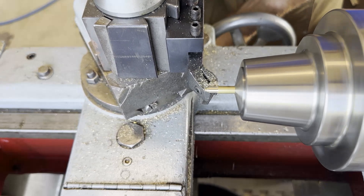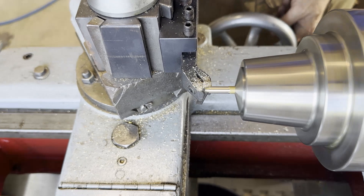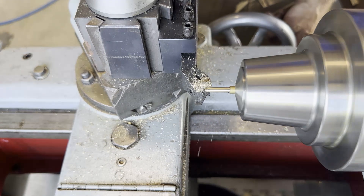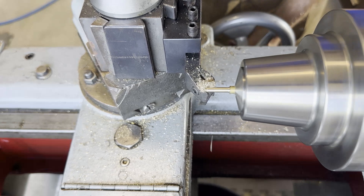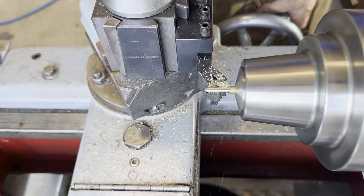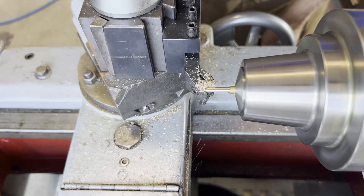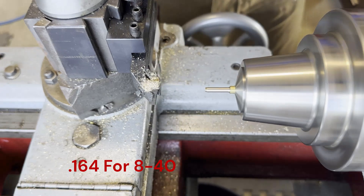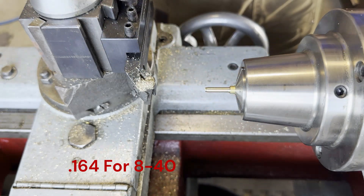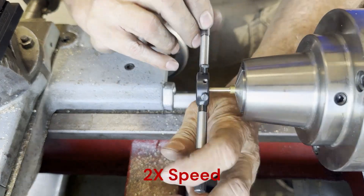Now we're going to make the stem that connects the barrel to the cylinder. It's just a long threaded stem — all-thread — and the problem is that when you take this down to a small size, the brass can get really flexible and you'll wind up with a wonky stem. I had that happen once and was able to straighten it with pliers, but I learned the best way to alleviate that is to get it down to dimension and thread it before drilling the center hole. We're going to want a hole that passes completely through this stem to let water and steam exit the cylinder and into the barrel of the cock. We're threading it 8-40 because that's what the holes are tapped to in the cast iron cylinders on the locomotive.